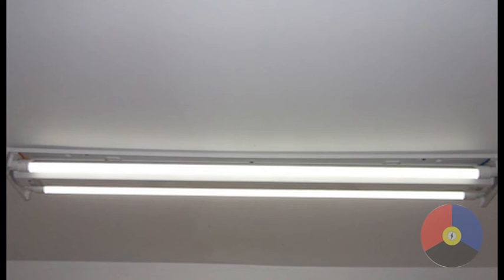If the LED tubes fail to light, disconnect the power and check all the wiring connections you did in the previous steps. Now you can replace the cover and you have a complete, converted, good-as-new fixture. Depending on your skill level, a fixture conversion will take between 7 to 30 minutes.